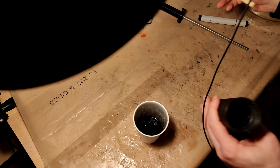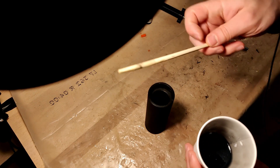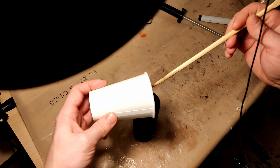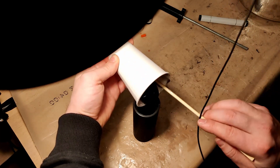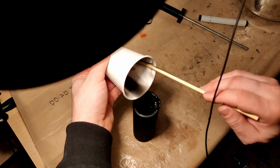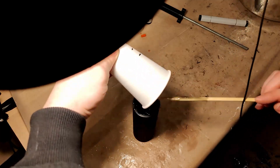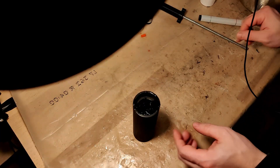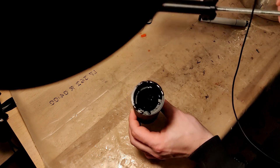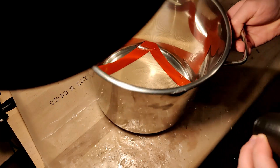All that's left to do now is put the silicone into the mold and put in the core. This silicone is quite viscous so we'll use a chopstick as a spatula to get it in there. As you've probably seen, I've introduced some bubbles transferring the silicone into the mold, so I think I can actually put it back in the vacuum chamber to get those out.